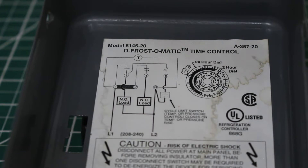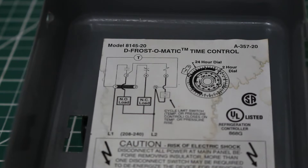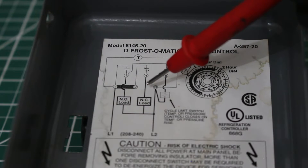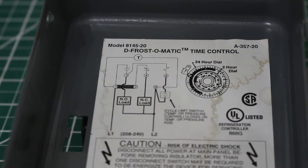Let's go over an example of how this may work. Line voltage goes into our normally closed contact, so power is always going to pass through there. Then we have a thermostat - some sort of temperature controller - within our normally closed load area. Power always goes through here into our thermostat, and the thermostat will essentially cycle the compressor or condensing unit on and off. So if we're calling for cooling, power passes through our normally closed contacts into our thermostat, and if the box is not satisfied it allows power through to energize our condensing unit.